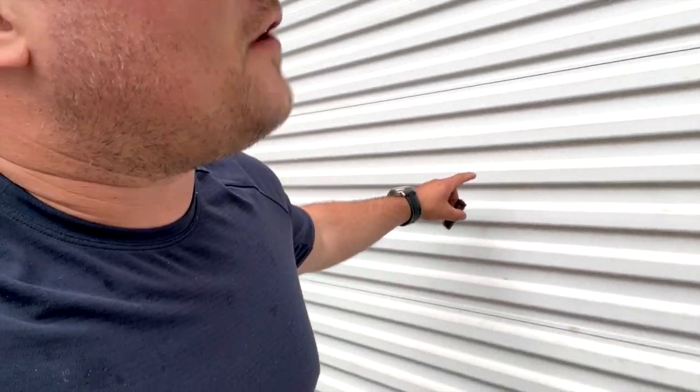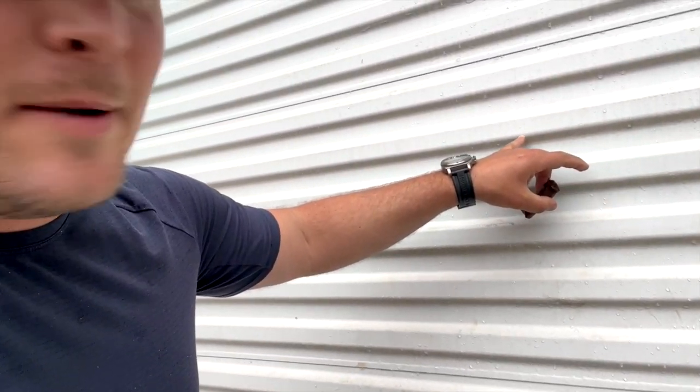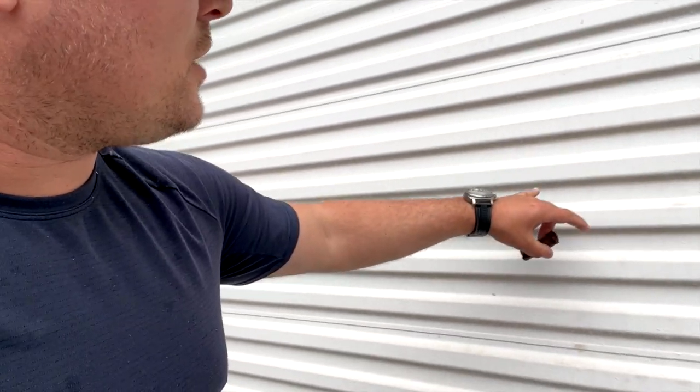This door is super oxidized. It's got a lot of fallout going on. Fallout is basically grime that you'll see sticking up under vinyl or doors like this. And regular SH — sodium hypochlorite bleach — won't get it off. High pressure won't get it off. And some of you guys know from some horror stories about Zorro striping up some people's houses with too much pressure.